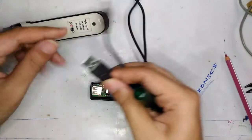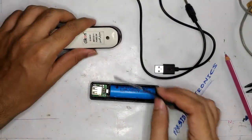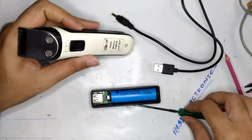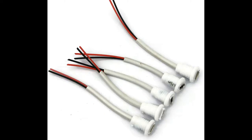I have a cable where one side is USB and the other side is a DC barrel jack, which matches my trimmer's input. If you don't have such a cable, you can cut a piece of wire and route it inside — the only downside is a cable dangling out, but if that doesn't bother you it's fine. If your trimmer has an AC input instead of a DC jack, you can purchase micro USB power connectors — available for around 5 rupees each online or from electronics shops. They come with black and red wires. You connect them to the circuit as shown in the schematic, make use of existing holes or drill a new one to fit the connector inside, and use any micro USB cable as your 5V input.